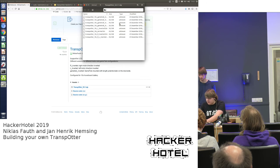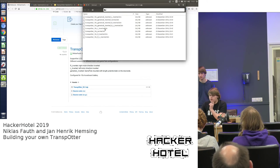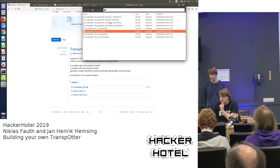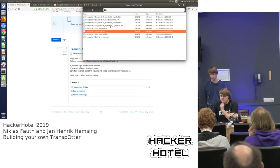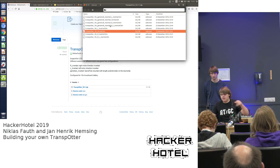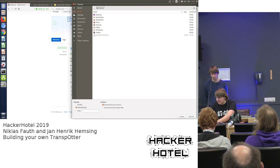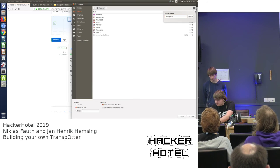And you can see that there are quite a lot of binaries that you can choose from. Those are pre-compiled for different motor configurations. For example, at some binaries, the right motor is inverted, at some the left motor is inverted, for some both motors are inverted. So depending on how you mount your motors and what motors there are, this way you can fix the driving behavior without modifying anything. But for now, I will just extract them all into a folder